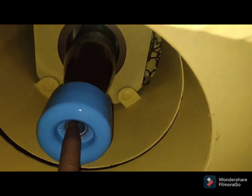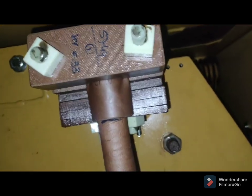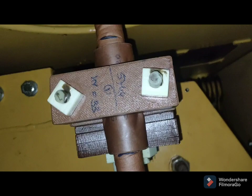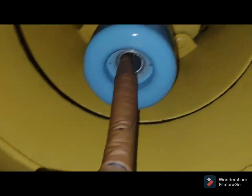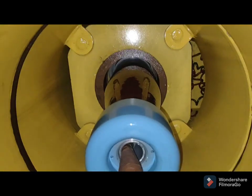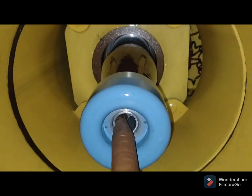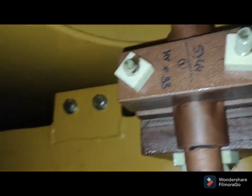The upper side is the current transformers of the turret — turret current transformers (CT). That's how we can measure how much current is passing through these bushings; we can calculate the current by help of this CT. This is the CT supporting the yellow phase. Upper side is the CT and blue phase is the bushing bottom, and upper yellow is the CT.